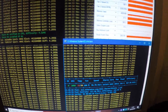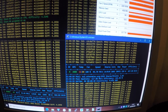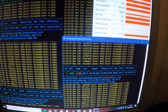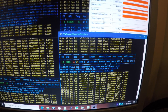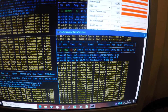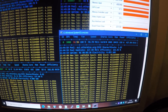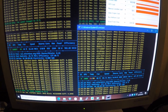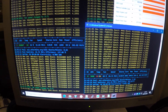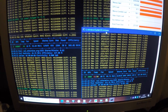This card has been running for a bit more than 2 months. I had to replace the pads because running it 24/7 is not easy to keep cool, and the thermal pads degrade very fast. So I expect that with this mod on the opposite side of the VRMs, I can hold this card a bit longer before I have to replace the pads again, since it's running cooler. See you in the next one. Thank you for watching.